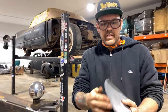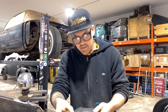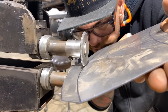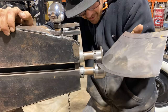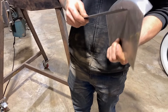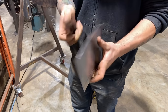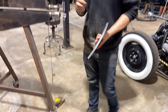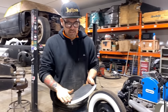You're going to see that the more we do this, it'll either get wavy here or our panel will start to bend — and that's once again because this edge will need to be shrunk. As you can see, it was either going to make this wavy or put a curve in our main panel. We're only at about a 45-degree tip and it's already distorted the panel quite a bit because of how much shrink it needs. So at this point it's getting harder to continue tipping, so I'm going to relieve this by shrinking it.